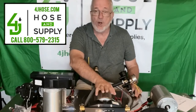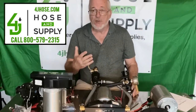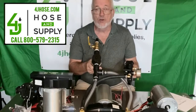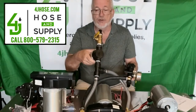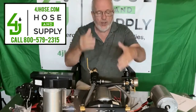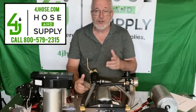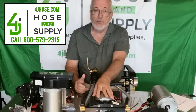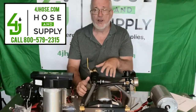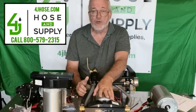What we have here is part number 80835 and it's a complete assembly — what they call a sub-assembly. It comes complete with all your plumbing: your inline filter, your ball valve to cut it off, and your regulator. This is ready to go. All you have to do is plumb it to your spray hose and to your tank. We do have instructions on the assembly and how to hook it up on the website product page. Just get it hooked up to your power source and you've got a DC pump ready to spray.